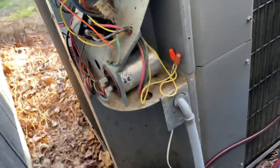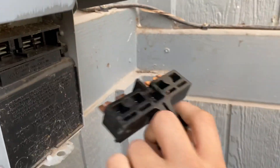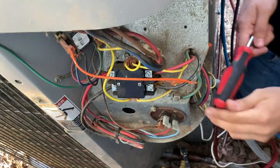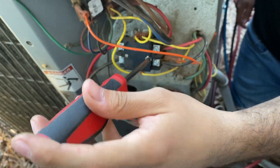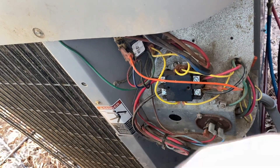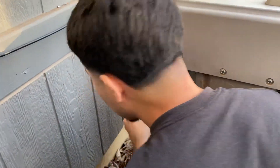Right here on the contactor, you want to take that cover off because you want voltage access. Let's pull the disconnect since I'm taking that top off — pull this off. You have no power, and then you can use this volt tester — you're getting nothing. Of course you always want to use a meter to verify. Take this top off the contactor because this is the voltage coming in. When you push your contactor in, it's pretty much bypassing 24 volts and that gets it going. Put this screw up here, take this off for the contactor.